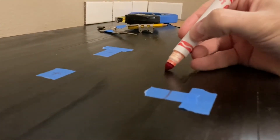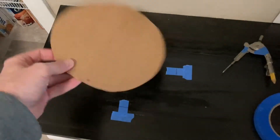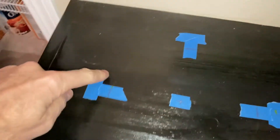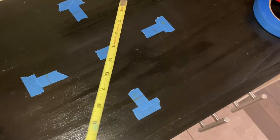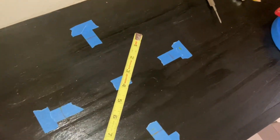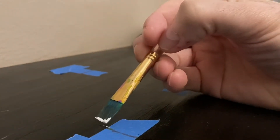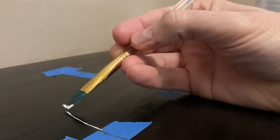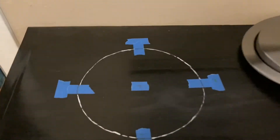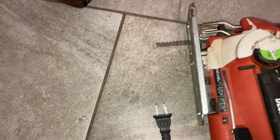I've got a sealed wood surface. You could also make a cardboard template, but I found the compass much more precise. If you have a dark countertop like this, the pencil line doesn't show up well — and you really need to see that line clearly when you bring out your saw. So I'm going to take some white paint and very lightly mark that circle, which will help me see it really well when it comes time to cut.